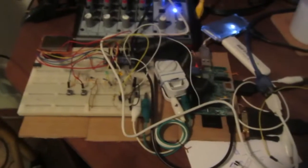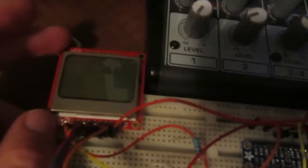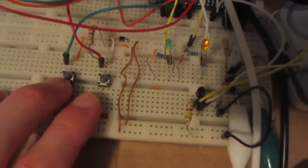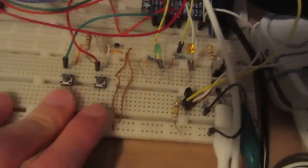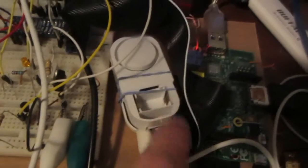Here's the prototype for version 2. It's powered by a Raspberry Pi. I've got the general purpose in-out pins broken out here using this Adafruit board. The idea is to have a little display — this is a display from a Nokia phone. It's a monochrome display with a white backlight. Here are two buttons that are going to be the buttons for each team: green team and red team. There's also this little siren thing I was thinking of using.